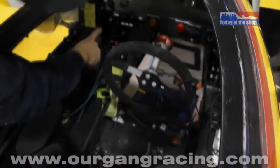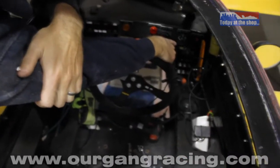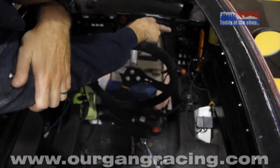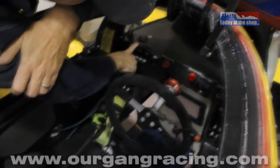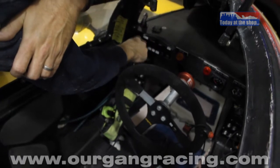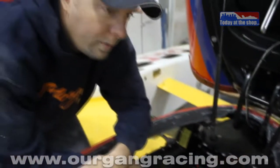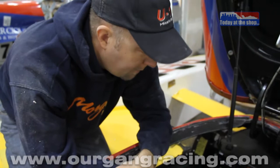Over on this side we have 12-volt electrical. Over on the other side we have 24 and 48-volt electrical. Got a couple of warning lights here — gear oil pressure and engine oil pressure. We also have the dash for the race pack data acquisition. The biggest thing I'm watching on this is exhaust gas temperature, especially at the salt water races. If we run into a situation where we're up 750 degrees Celsius or higher in exhaust gas temperature, it's time to shut this thing down.